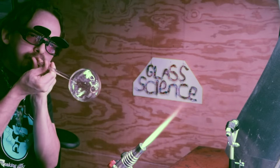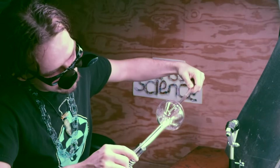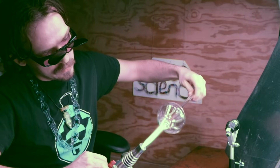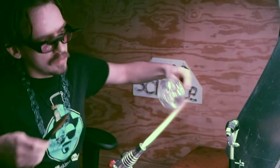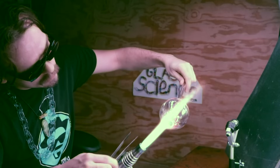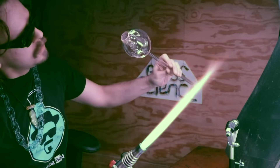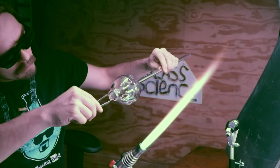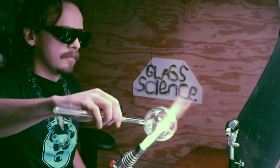I blew out a really thin bubble and I'm going to pick it open with a glass rod — it's just another way to pop open a hole without creating a lot of bubble trash. I'll use a brass reamer and the mini jacks to open up this hole very slowly, eventually getting it up to a couple inches for the tubing that's coming. That's going to do it for part one — part two is coming up this week, which will include dropping that tube and pulling points. Make sure to check it out, and thanks for watching.